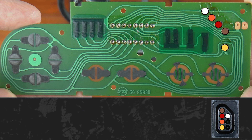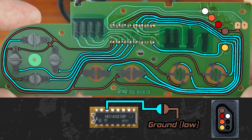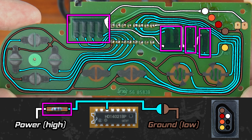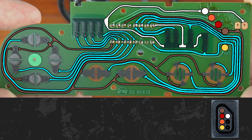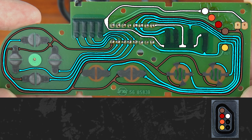A fair question here is why do you need power and these carbon printed resistors? Why not just tie the pin directly to one side of the button with ground on the other? The answer is the pin needs to know at any given time if it is high or low. When you tie it to ground it is low, but if you don't tie it to anything at all, the pin is floating. These resistors — called pull-up resistors — give the pins their default high state. The resistor between each signal and power is important because otherwise you'd tie power directly to ground whenever you press a button, which would be bad. Don't cross the streams.